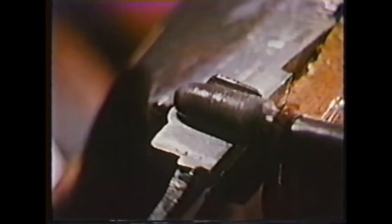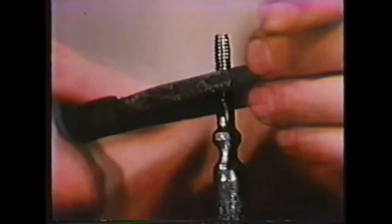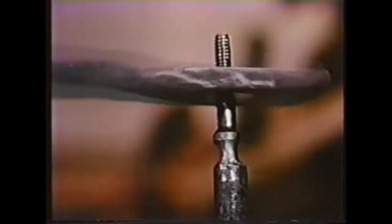I made the pan borer, which is used to shape the cavity for the priming powder. I cut teeth on it like a file instead of making flutes like a reamer. I make just about all of my tools, except for files and hacksaw blades. Even things like screw plates or dies are easier to make than the lock of a gun.